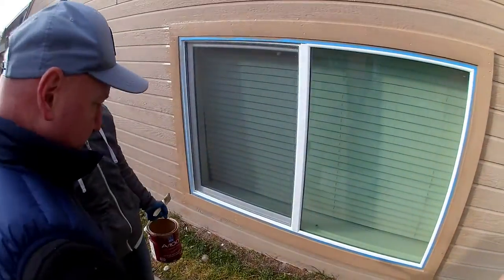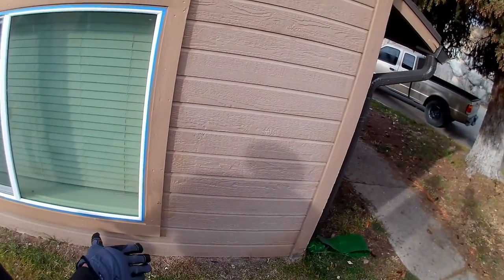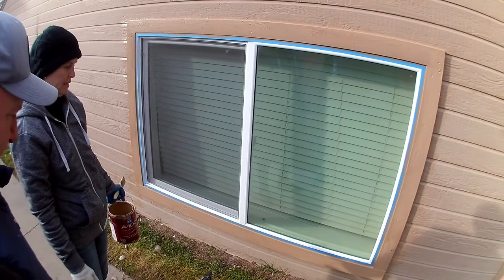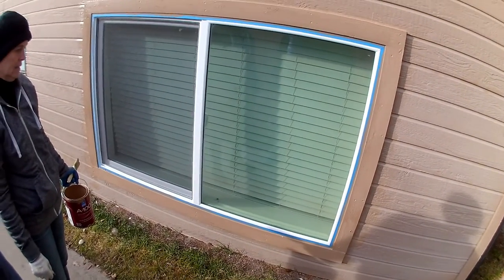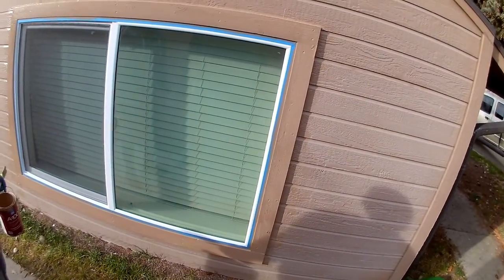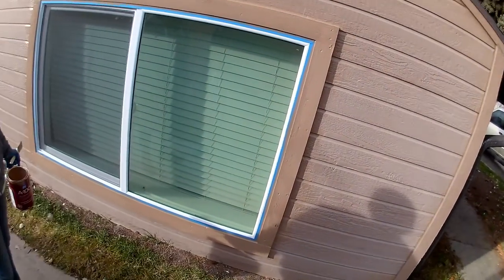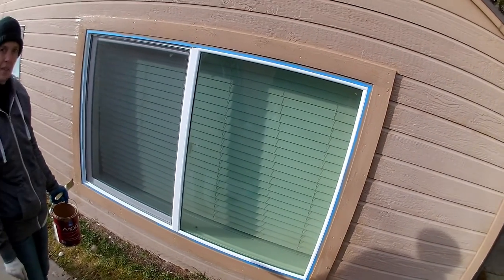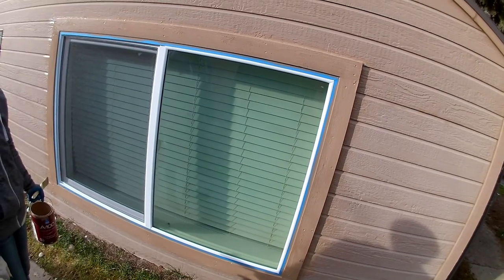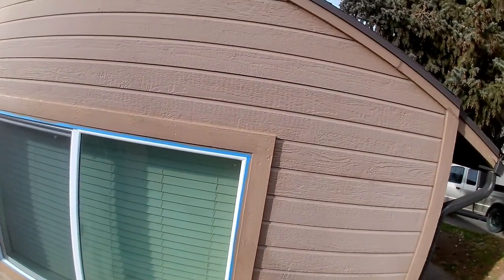So this is the primary area where water presses in. And what you see is water, and even when it's done, sometimes some dirt and soil will be inside towards the bottom of this wall. The bottom of the wall is a couple feet below ground level here. The first thing I'm noticing is you don't have any visible foundation here, so you're going to want to expose your foundation. First off, if you've got soil right next to your siding - that's going to be a haven for termites.